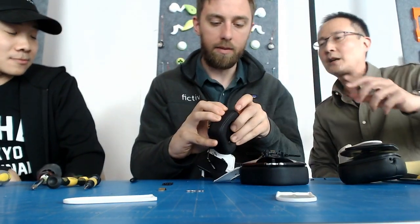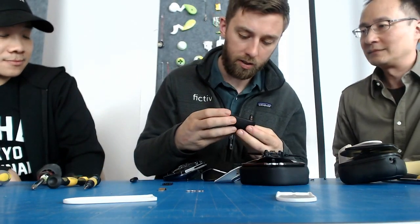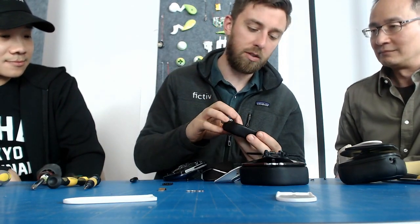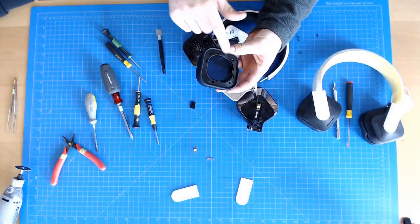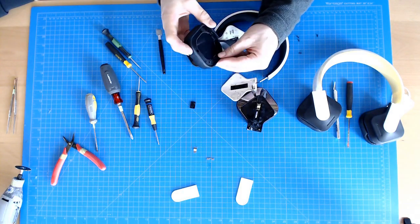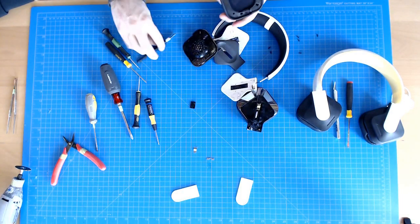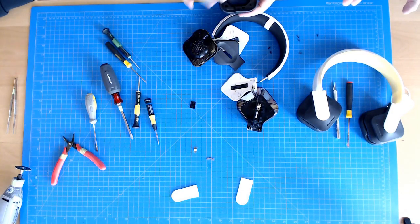The ear cups also snap off, the foam part. Oh wow, this is cool. This is an injection molded part. We can obviously see the different ejector pins on the outside, and then it's just glued or adhesive on. Adhesive leather. We learned a lot about this because there are suppliers who specialize in making that entire assembly. There's a layer of mesh that protects the speaker from dust.